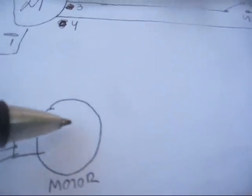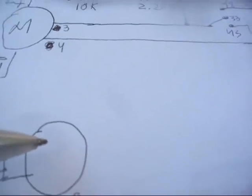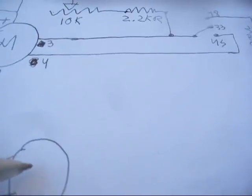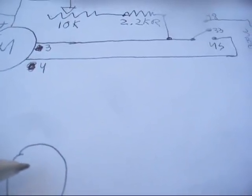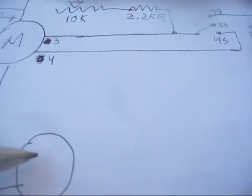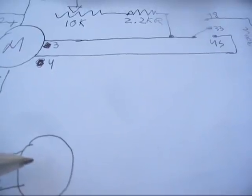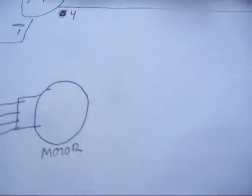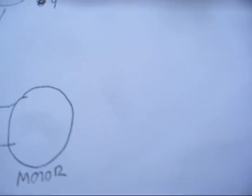This motor has speed regulation circuitry built in it and 2 trim pots inside the motor. The one marked L is for 33. You should adjust that one to get 33 right, and then once that's right, you flip it to 45 and adjust the pot marked H to get 45, and do so with an insulated screwdriver, even if you have to wrap masking tape around it.